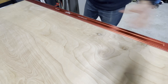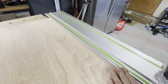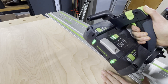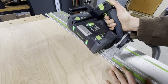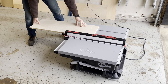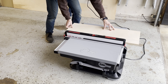I wanted to cut out the base first, so I marked out the size of the sled — it really depends on the size of your table saw. I used a track saw and cut it to length, then got the width I wanted. I wanted it pretty big so I could handle at least two-foot pieces. Then I went to cut the front and the back so they all became the same size — I think they were like three inches or so — and just set the table saw and ripped it all to the same size.